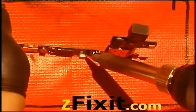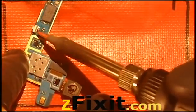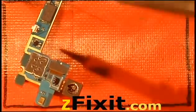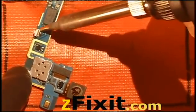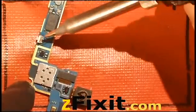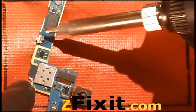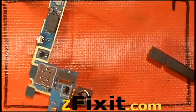Now you have those left and right joints. Those two points cannot short on the casing of the switch — there's a little pad on the switch, it's hard to see, but you'll be able to tell. It goes from the solder pad to that switch. You cannot have too much solder where it connects to the casing, or it's just going to be constantly depressing the switch. So once you've soldered it, make sure that the solder only goes to the pad on the switch and not the metal casing of the switch — sometimes if you put too much, it will.